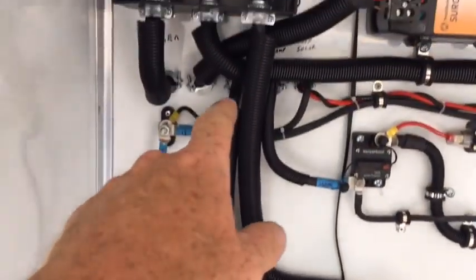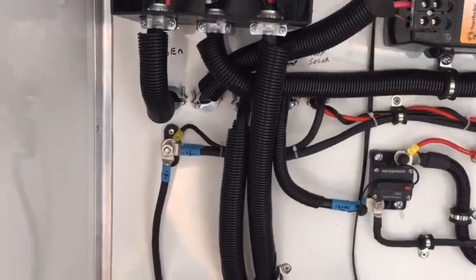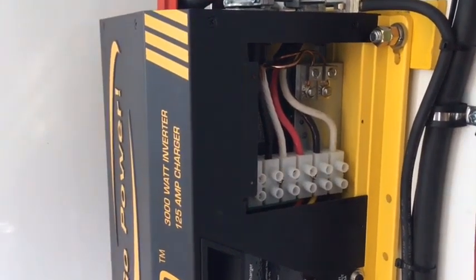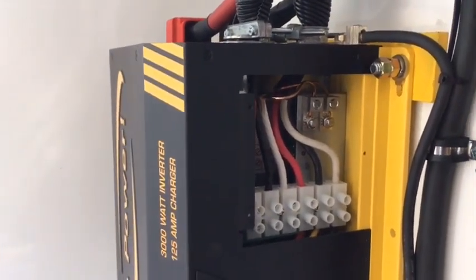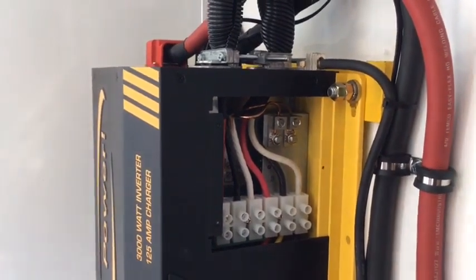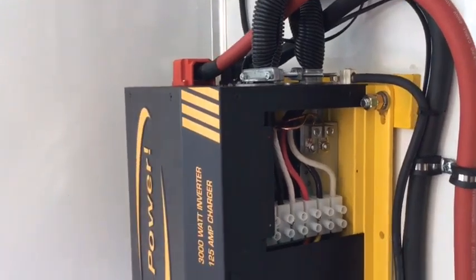Following out, up and back into the trailer or the circuit breakers. The Gopower IC3000 has a 50-amp transfer switch on some models; some models contain a 30-amp transfer switch. This allows shore power to pass in and pass out without any disruption of power.